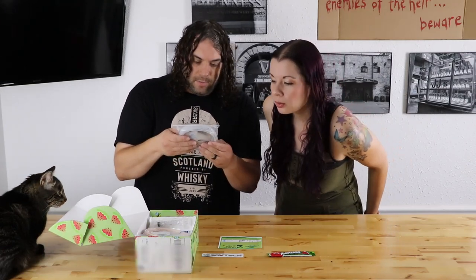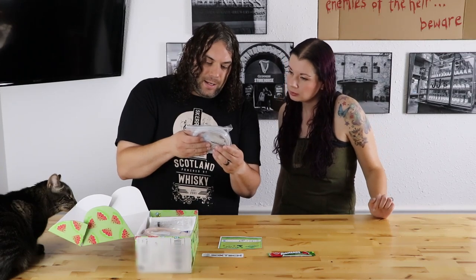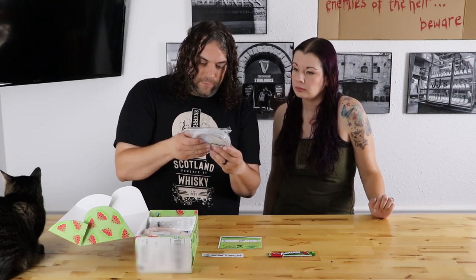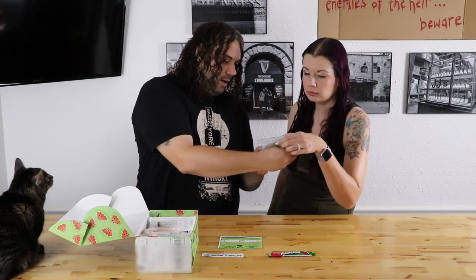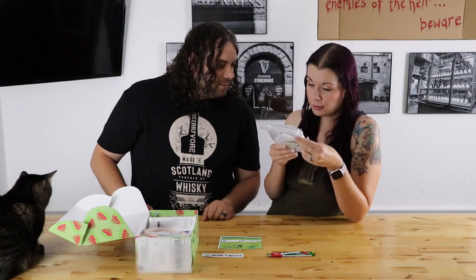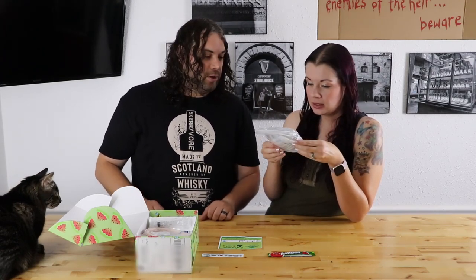The first thing we're going to pop out is marble PLA. The extrusion temp is 190 up to 220°C. Bed temp is 0 to 60°C and speed 50 to 90. That's from Z-I-R-U-I — not sure how you say it, sorry, we probably just killed it.